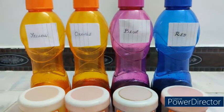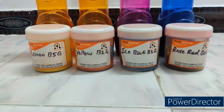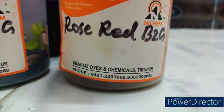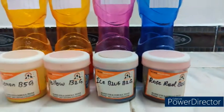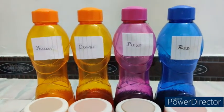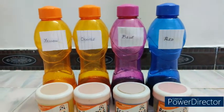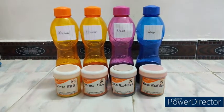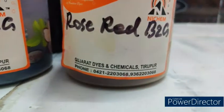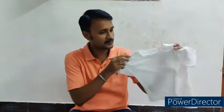For this dyeing trial I have chosen four colors: yellow, orange, blue, and red. I have made a one percent standard solution of all four colors and stored them in pet jars. These colors are sourced from Gujarat Dyson Chemicals, Tirupur — their contact details are provided in the description. The powdered dyestuff is weighed accurately, pasted with liquid soap to improve dissolution, dissolved in distilled water based on depth percentage required, and filtered using a cloth filter, since dye transfer happens via medical syringe and there should be no lumps for trouble-free dyeing.